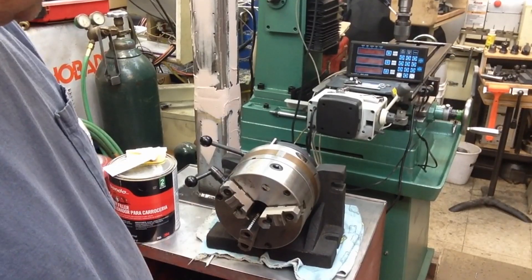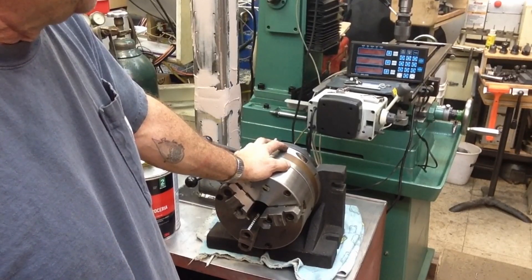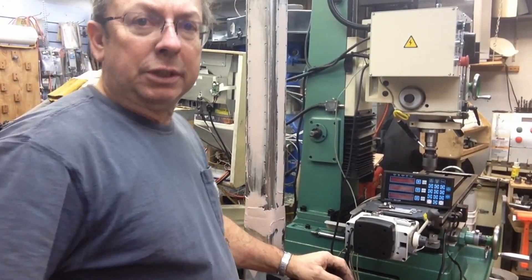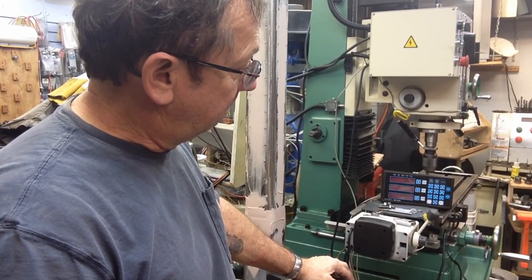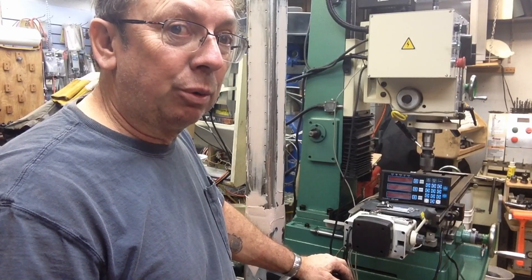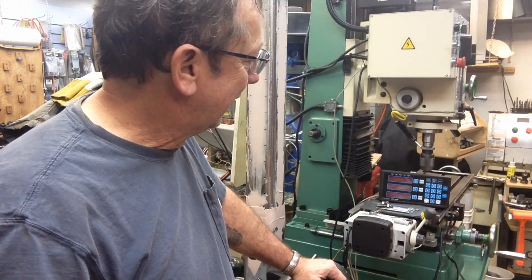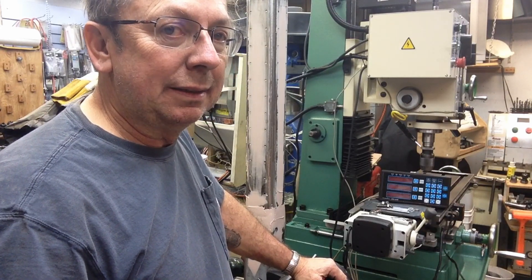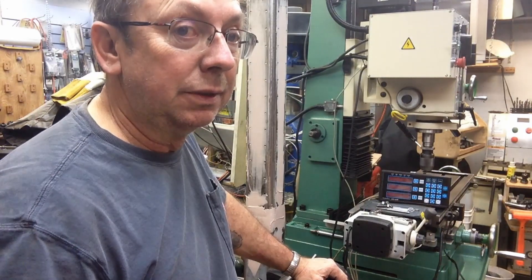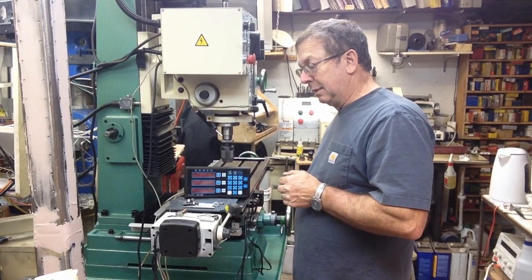That's eight inches; six is only going to be two inches smaller, and I think realistically for this size mill drill, about five inches is about right. I've looked at some four-inch stuff and I almost think four inches is a little too small — it'll probably handle 99.9% of everything I ever want to rotate on this mill table, but it seems a little small, almost in the toy machinist parts territory. I think for a rotary table on this mill, about a five-inch is just about ideal.